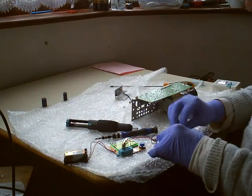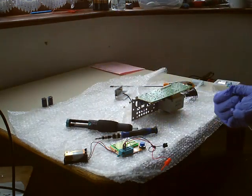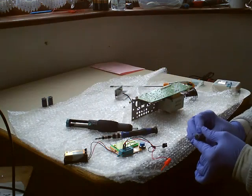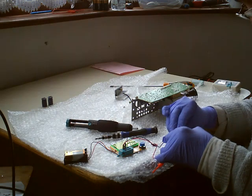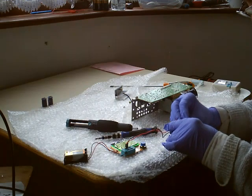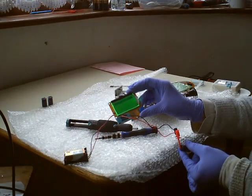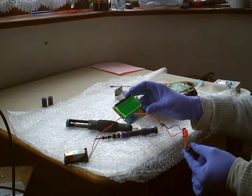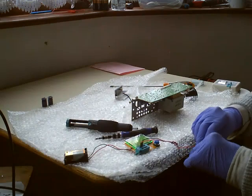Right, so we have had something that jumps out at us. This capacitor has gone short internally, and that is the reason why it is not working. It's coming up as a resistor — 0.24 ohms. So this is basically a dead short.